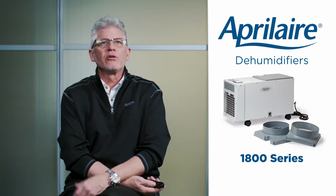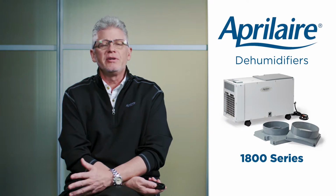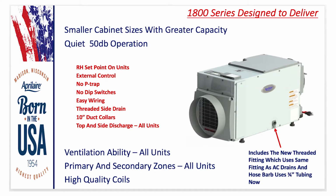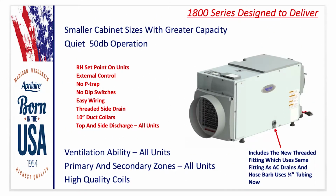So let's just look a little bit closer at the 1800 series. Now these are really designed to deliver. They're smaller cabinets, they all operate around 50 dB, so they're super quiet. That's about the sound of a modulating furnace running. They have RH set points right on the units. They're available to be controlled externally. The P-trap is now gone, there are no dip switches, they're super easy to wire, and they have a threaded side drain now, which is actually a much better way of connecting your drain tubes. All the units that have collars come with 10-inch duct collars, except for the model 1820, which has 8-inch duct collars, and all of them have top and side discharge. Another change is that all of our units now ship with aluminum coils, which are super high quality.